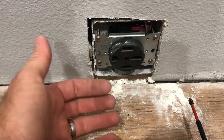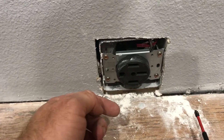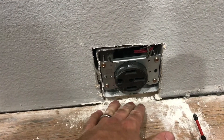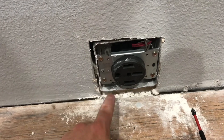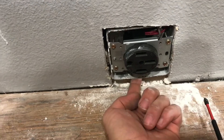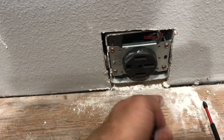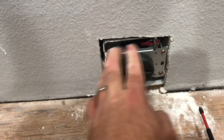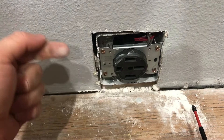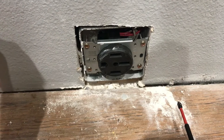Maybe it's not always that you can get that lucky and it's that easy, but for me the wires are coming in the back of the box so I can rotate it around, and it's screwed into the sill plate or the footer plate for the wall. I did have to modify it — I had to drill holes in the box itself because the 2x4 is actually back up under here, so I couldn't use the standard screw holes on the edge of the box. I drilled holes in the back corner of the box so that when I tightened it down it sucked it down tight. It's not perfectly square in there, but it's behind the stove anyway, so it doesn't matter. Point being: when you go to install your box for your stove, maybe you should consider installing the box sideways, because that's what I ended up having to do.